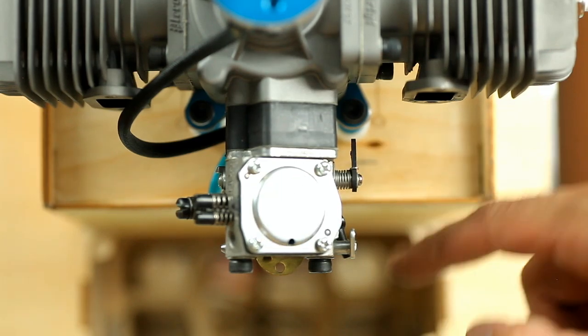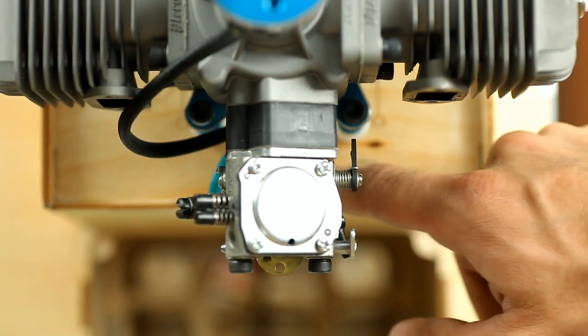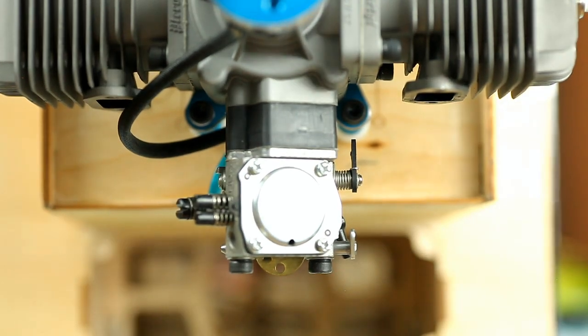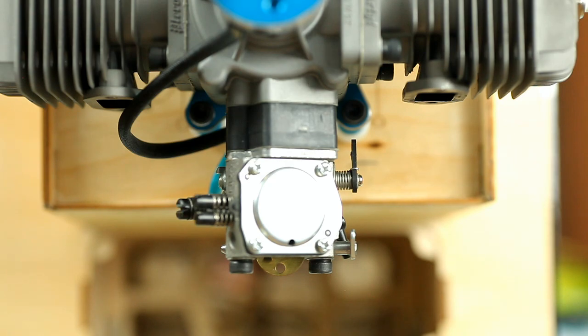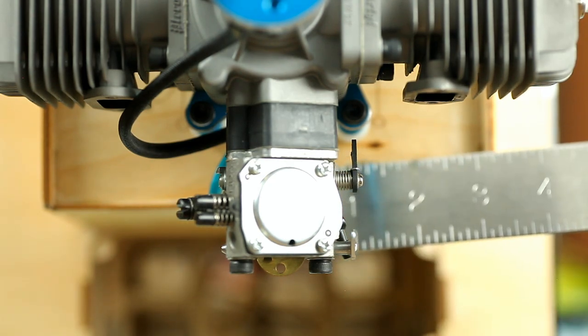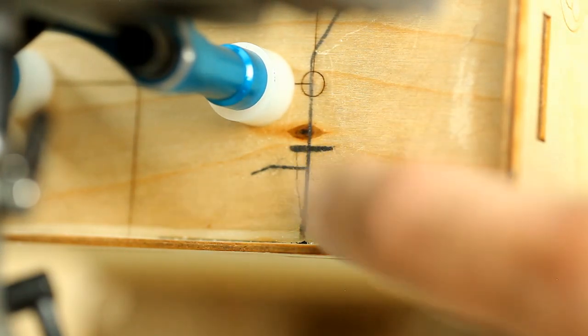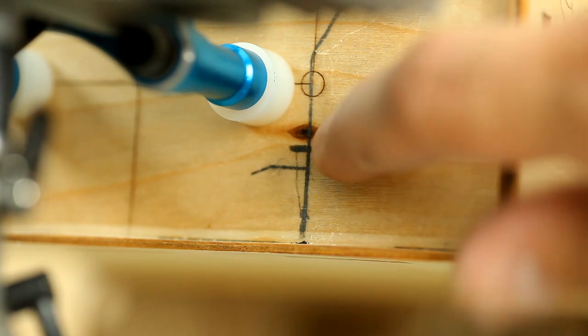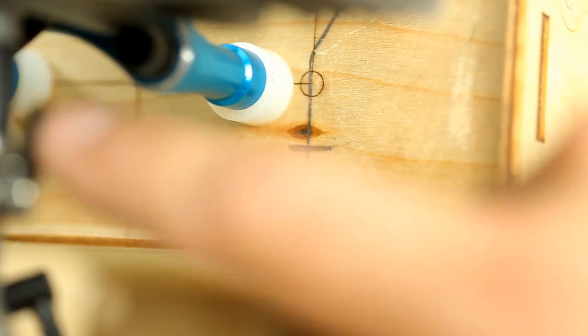and we're going to find that this arm is right about 1.25 inches over from the center of the engine. Now the center line on the firewall is kind of blurred out now, and a little hidden, but the center line that's marked on the firewall, we just need to be 1.5 inches over from that. So you can see our planned insertion point right here where we're going to drill the hole for the throttle rod. It's 3/4 of an inch up from the bottom. This marks that 5/8 inch origin point of the throttle arm.